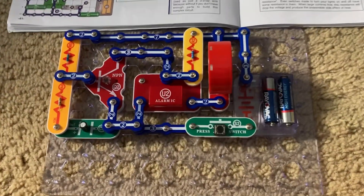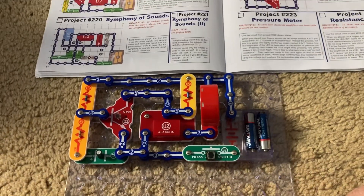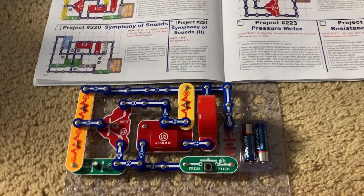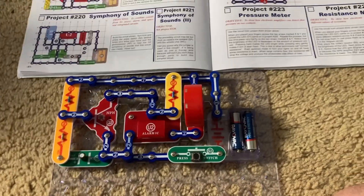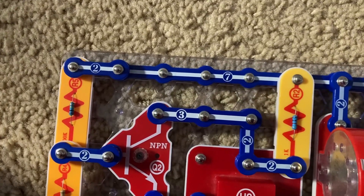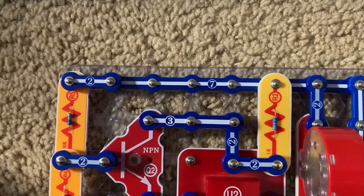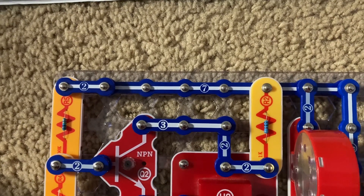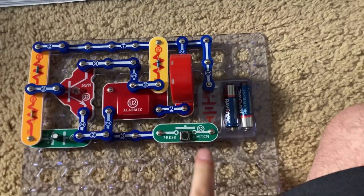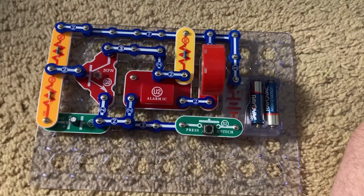I'm not sure exactly how long you'll have to wait — they say just a few seconds, but it seems to take longer. You don't actually have to do anything else with the circuit for the capacitor to recharge, so you can use the gun again. Once it's fully charged, you can hold down the press switch again. You could also shoot long repeating laser bursts or short zaps when you tap the press switch. You'll be able to fire for a longer period of time if you do it in short bursts.